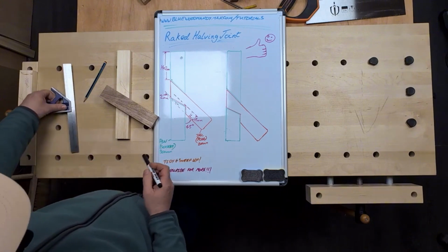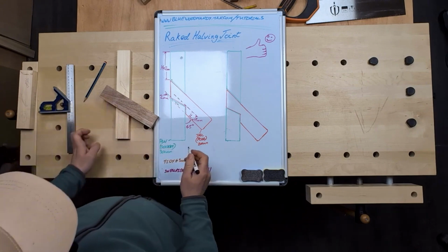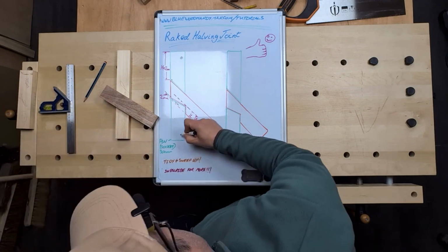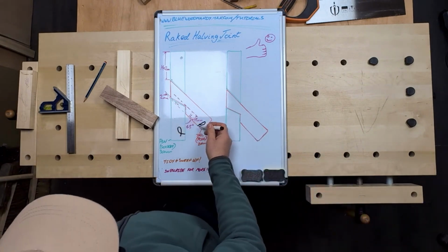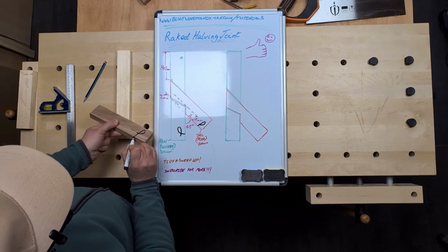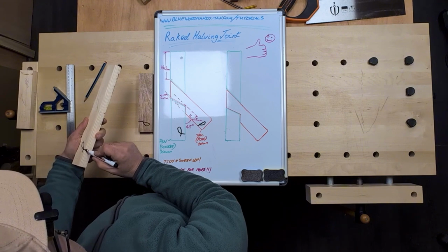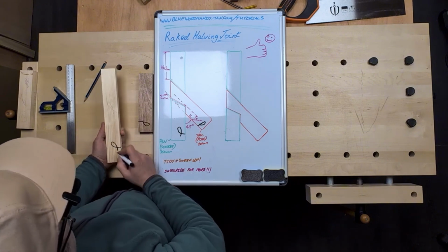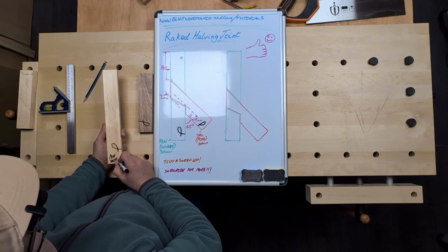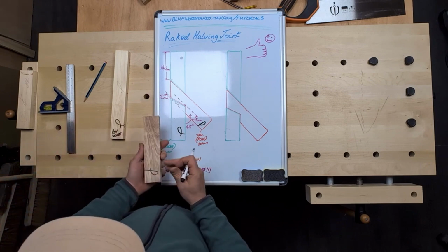So our first thing that we're going to put on these two pieces of timber, actually on the timbers, will be our face side. That's our face side, so we know where it's pointing to, so our edge is going to be down there. We've got a face on that one, and a face and edge on this one. Let's call this one our pin, or the socket. I stepped through this because it is important to label all this.